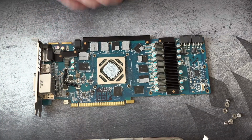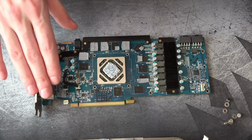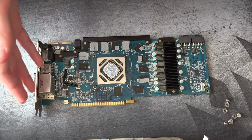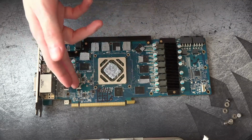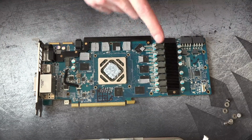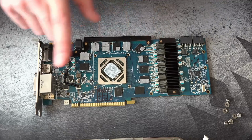So in my infinite wisdom, I'm being sarcastic, in my infinite wisdom, I decided to just grab the correct voltage from somewhere else. Now, we can't grab it off of VCore, because VCore normally goes to like 1.2 volts or higher, and that's just going to blow our PCIe and everything to smithereens. So that's not going to work. We can't grab it off of memory power, because that runs at 1.6 or 1.5 volts or something, just way too high. Like, that's even worse than VCore.